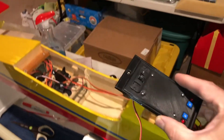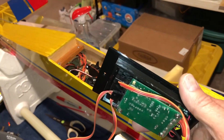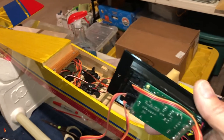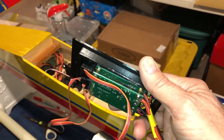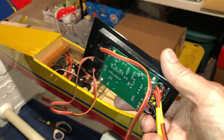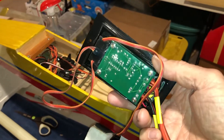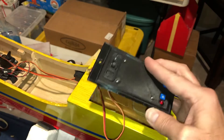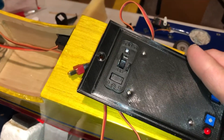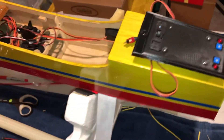This little device here is the actual flight-tested unit. I had it on another Ultra Stick with an 80T engine — a smaller, newer version of the Ultra Stick with a smaller fuselage and wing. This version has two cards daisy-chained together. Power from the receiver battery and the glow battery both connect into these cards, which then feed out to the glow plugs. It fits in the hatch opening I created, has an independent power switch for the glow drivers, separate from the receiver battery switch.